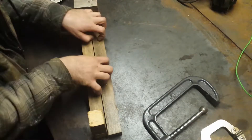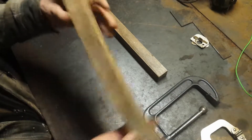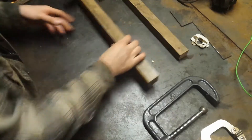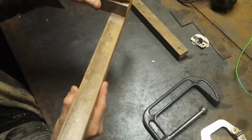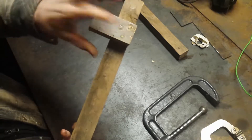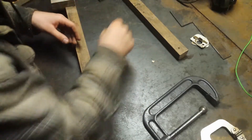Now this is about the simplest way that I could figure out how to do it, and it's not perfect, but it definitely worked. Basically, I took some 2x2 pine and made an L-shape out of one using a mortise and tenon, which is only the second one I've ever done. The other piece is just a straight piece of 2x2 with a little piece coming off here, as you can see, that's been glued and nailed down. I didn't want that butt joint to come loose, so I used 3 eight-penny nails.